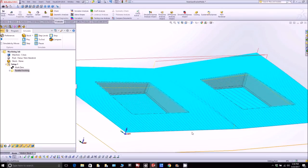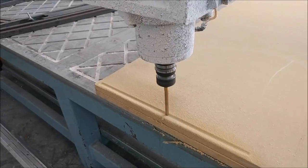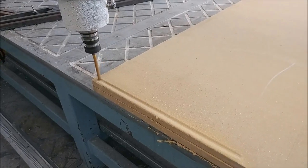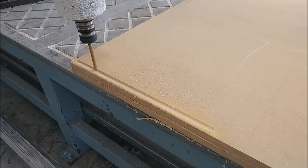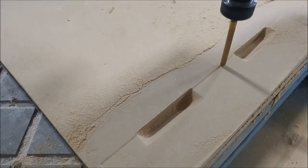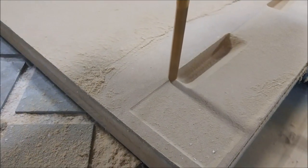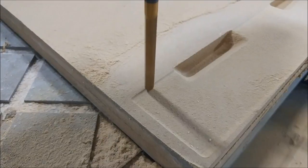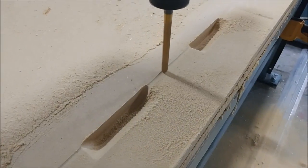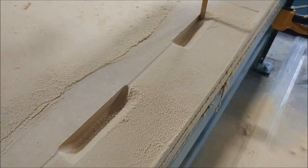There's a tool path on there highlighted in green and blue, and here's the machine running this afternoon — just running with the MDF and a three-eighths inch ball mill, going back and forth with a really tight step-over. Once this comes out there shouldn't be hardly anything to do to it — just wax it and lay up the parts in there. You can see it's quite a bit further along, doing a nice job. It won't take long to have that quick mold done, so you'll see those two parts being laid up in the next video.